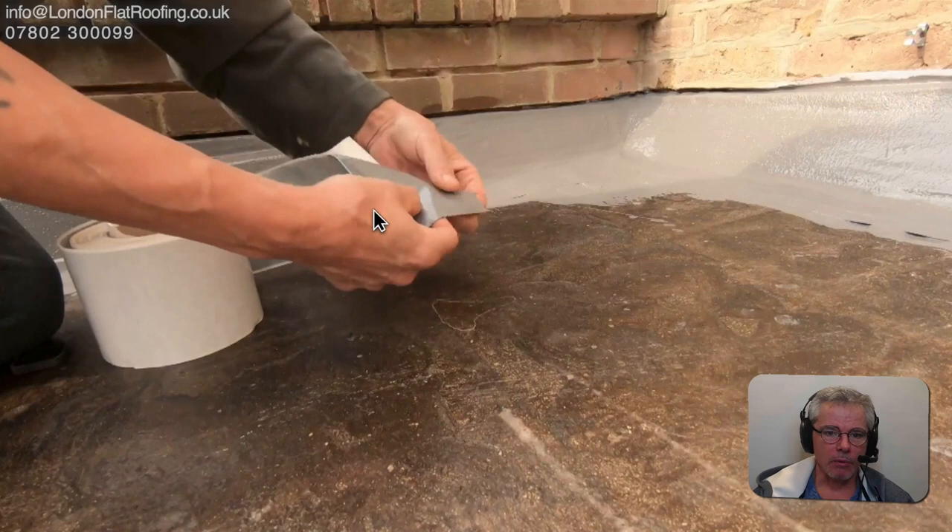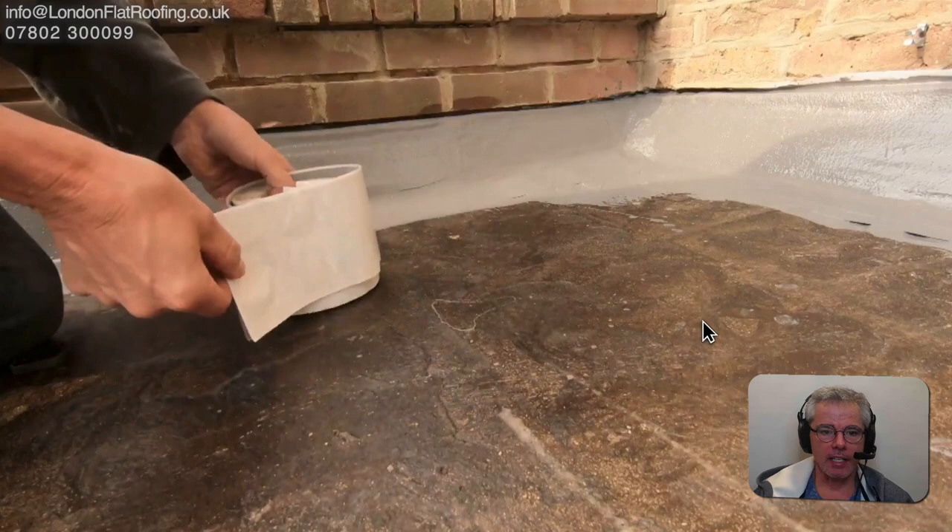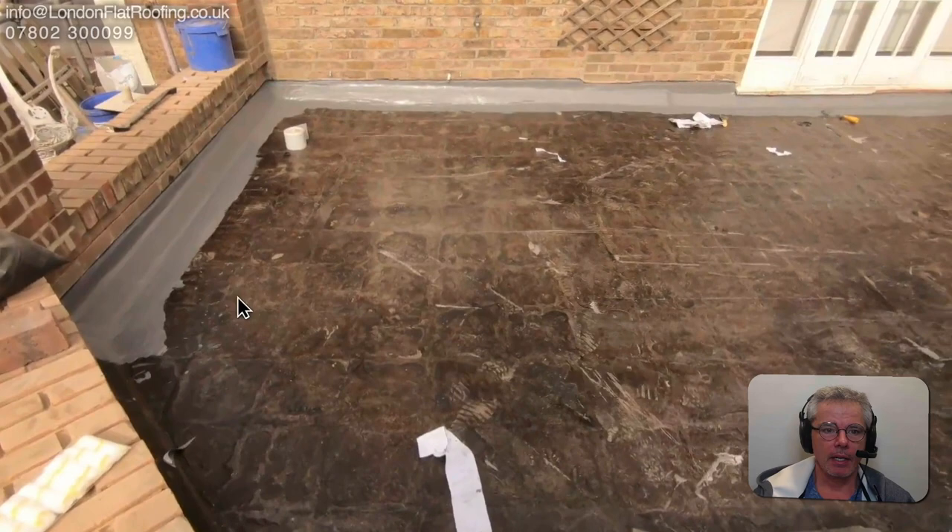Again, a good example of the chase - you can see we've gone around and put our first material around the edges. I'm showing you here one of the sticky back tapes we have for joining over joints. This makes joints in the asphalt flexible over the top, just in case there's any more expansion. Historic cracks will all be taped with that kind of tape.